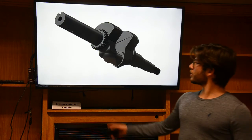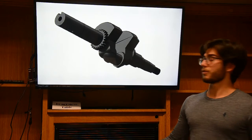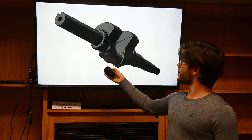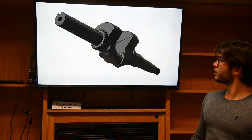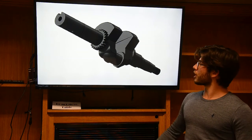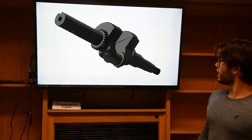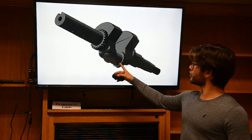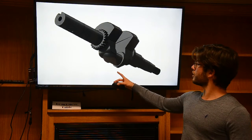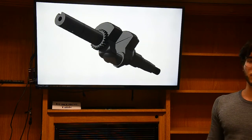Going on, this one was the most difficult part, because I had to use a new function, that is revolve boss base, and in the end I built it with this function, and it was pretty good with respect to the original one, because I obtained also the angles, as you can see. And I paid attention to the non-symmetric part here. In fact, as you can see, we have a lower space on the bottom than on the top part.